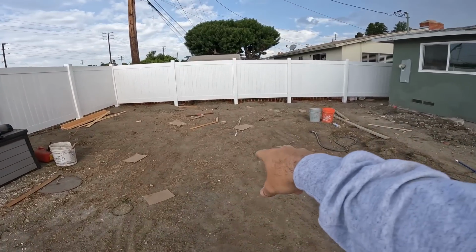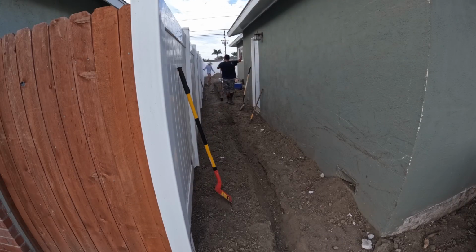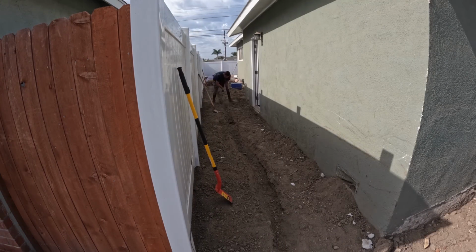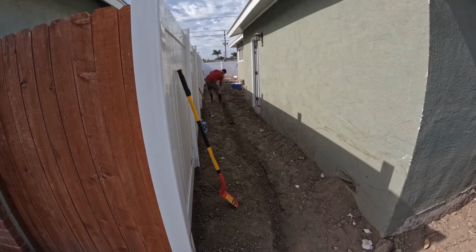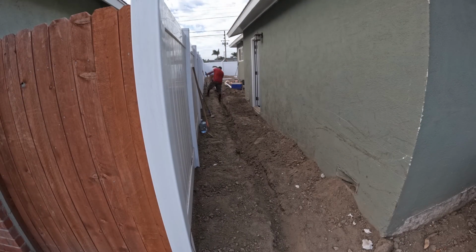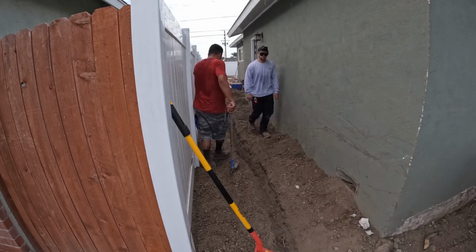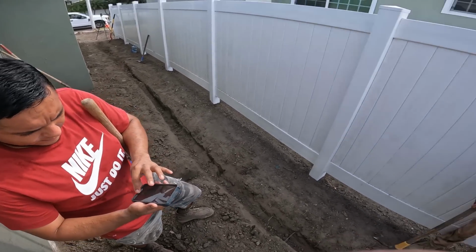Now I just gotta find the center in this area right here. Here's the drain line. They're just gonna locate that drain line right down the center of this because that's where the drain's gonna pop up. So you can just slap 10-foot sections, put T's for your uprights, and then cut to length on the height of your area drains.